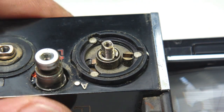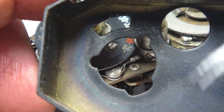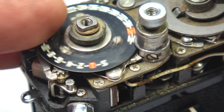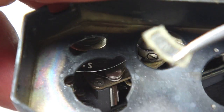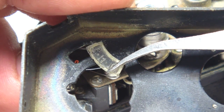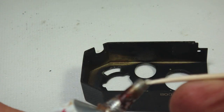Carefully lift the shutter release button lock lever free, followed by the right side top cover. A loose counter window is the cause of the counter dial not functioning earlier. With the loose counter window not pinned between the counter dial and the top cover, the counter dial rotates freely. The counter window will need to be glued back into place. Pliabond works ideal in this application.